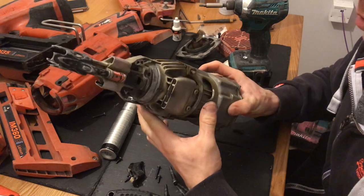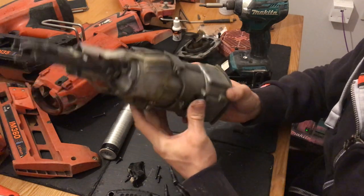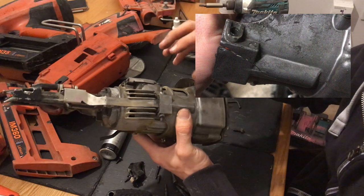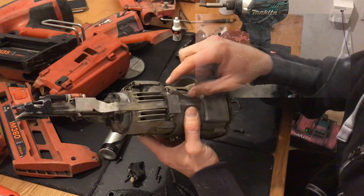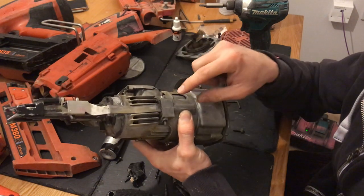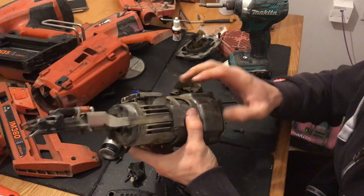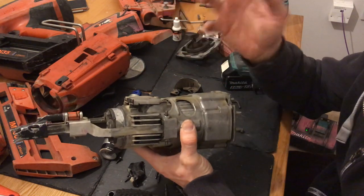On your 360, if you ever send it off to Paslode and they say your chamber's cracked — it normally shows like there's a crack down this piece here — that's not actually an issue. They'll probably charge you about 300 quid to replace the chamber. But if the pin's still intact, you might just need to replace this pin here. If it does have a crack down here, the gun still works as long as this pin is holding it all together. The fracture in that chamber doesn't actually have to do with anything firing.